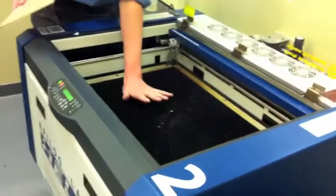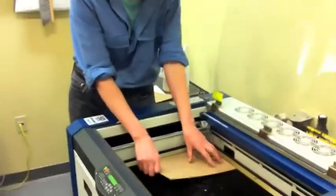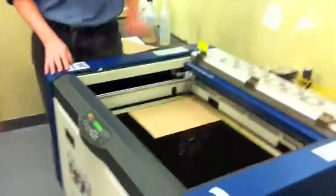That means you're delivering surplus heat either to the vector grid itself, which gradually wears it down, or maybe to some affordable sacrificials we don't have to worry about. Please protect the equipment. Alright, so I'm going to install the workpiece itself and the sacrificial.